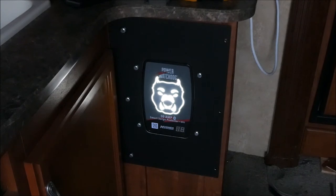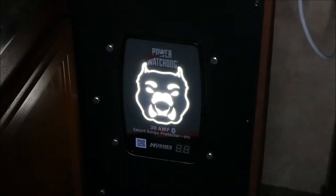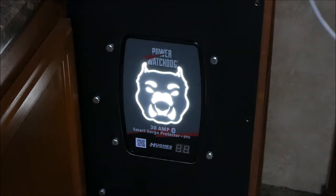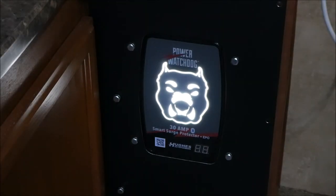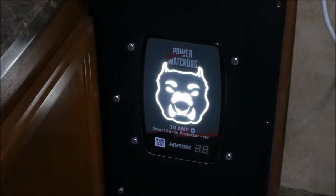I think I'm going to turn it on before I go any further. Looks pretty good. I'm going to go plug this thing in — I think it's going to go through some sort of self-test and then turn bright white. Unless there's something wrong, it'll turn red. I shut all the breakers off. Since it's bright white right now, that's a good sign. I'm going to turn the breakers on. Everything is on. This guy says we have 120 volts coming in. So everything's working the way it should. This will only light up if there's some sort of error. We have the codes here, E1 through E9. When it's all white like it is right now, everything's good. I suppose that'll make for a nice night light too if we're plugged in somewhere.